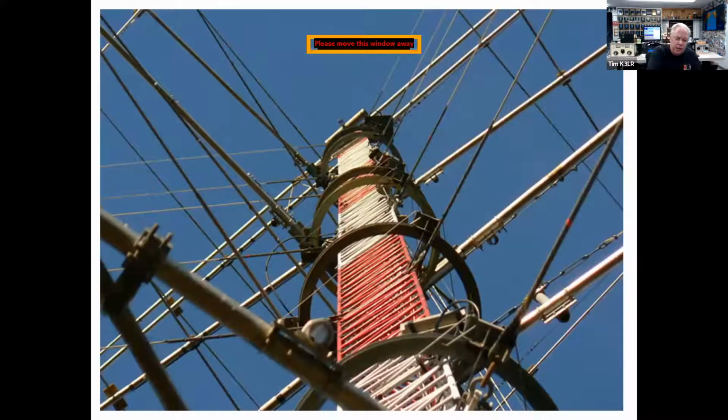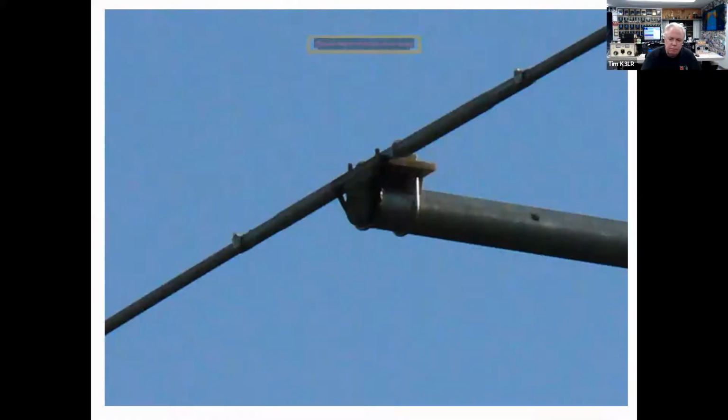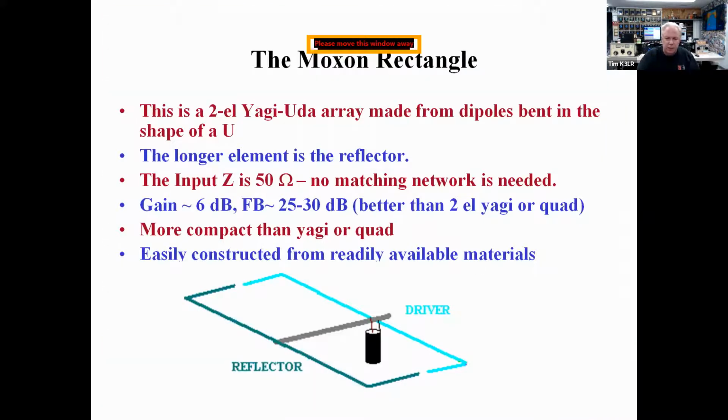And you can use ring rotators to rotate antennas around the face of a tower. That makes use of the side of the tower. This is the 20-meter tower here at K3LR with multiple stacked Yagis on ring rotators. And to insulate elements from the boom, this is a piece of garolite. This is a 15-meter element at the end of the boom.